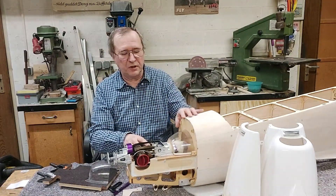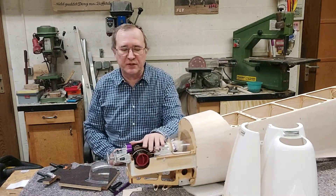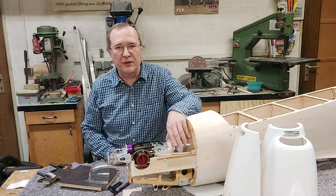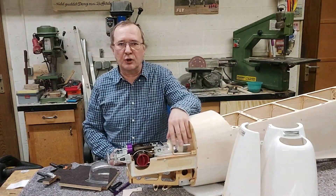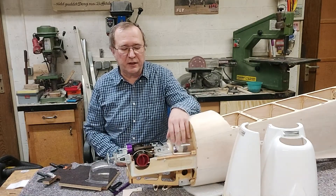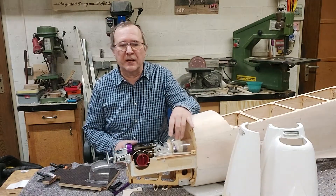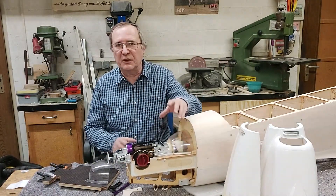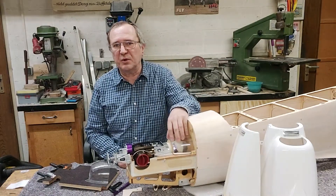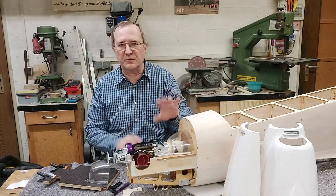The part is inserted and fixed with four screws around it. Now we have separated the heated exhaust area from the engine intake area, which is really important. I have never seen anyone else doing this, but I have seen pilots at shows when it was really hot outside — they finally couldn't fly because when accelerating they had compressor stalls. They said turbines are no good for hot temperatures, but I never had this problem because I really looked after keeping these two volumes separate.